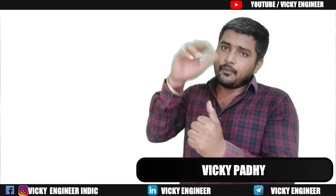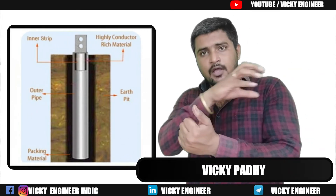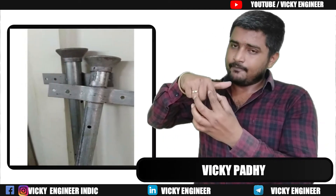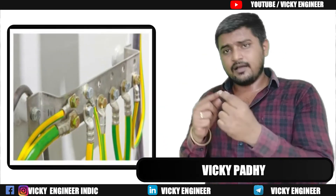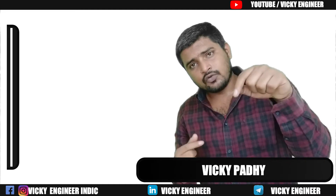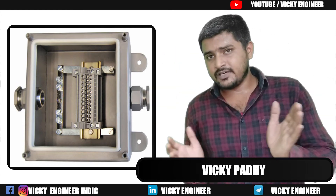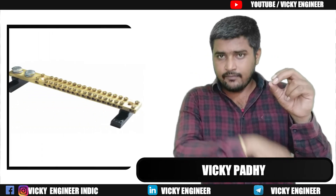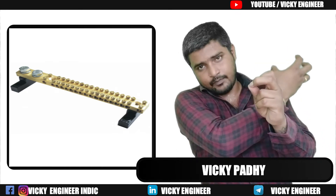After pouring the slurry, how do we connect the top part with the earthing wire or strip coming from any home or project? The proper way is: once the rod comes up, there should be a busbar-like structure on top. You have to use a copper or GI lug — they are available in the market. That will fix it down properly and go to an earth terminal. Just like the MCB box in our home or any project has an earth terminal box with a busbar-like structure, the incoming wire from the earth pit is connected to it, and the next holes are connected with wires or strips from the project or home.